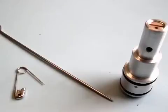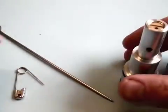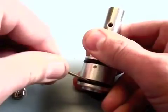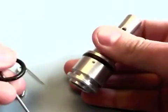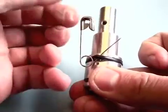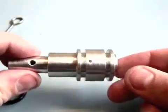Countless times I've seen people struggling trying to get O-rings off of various things — not only to do with air guns, but all sorts of mechanical and hydraulic assemblies. All you really need is something fairly strong but small and sharp, such as a pin or meat skewer. If you get the pin sort of on the centre line axis, wiggle it down and then twist and bring it up underneath — that's the easiest way. Then you can just pull it straight off. Put it down the centre, twist it underneath, pull it up, and you can simply roll it off of whatever assembly it is.